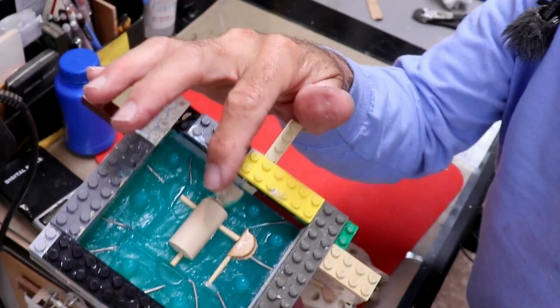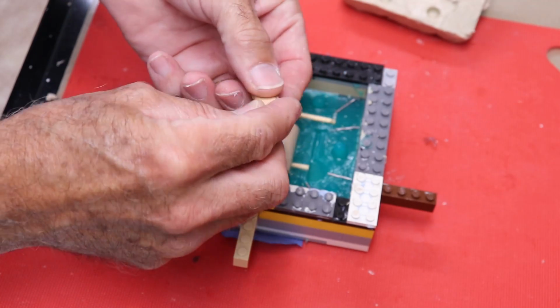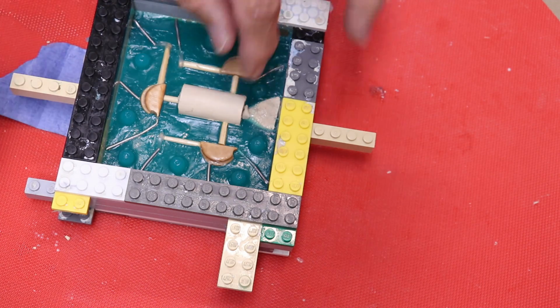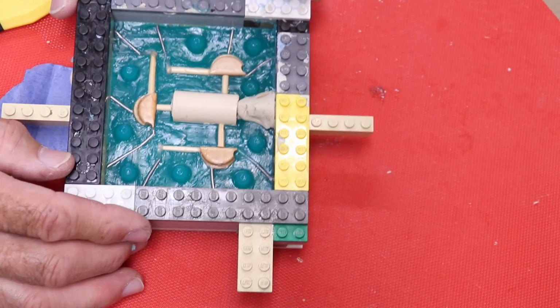Vaseline all the existing silicone in there, and then we'll pour the next layer. So while I'm putting these back, I'll clean them up a little bit too. And make sure they're not carrying any clay with them. And that's the little piece of clay I put in there to form the sprue. So I'm going to put a little piece of clay to form the other half of that. Doesn't have to be anything special. And that should do it.